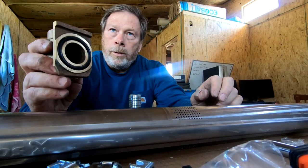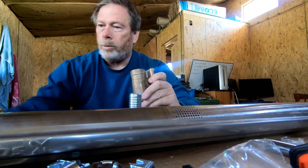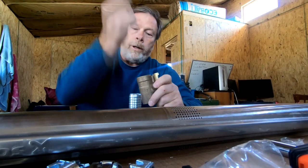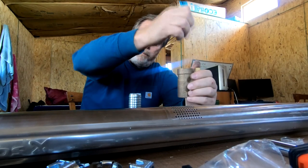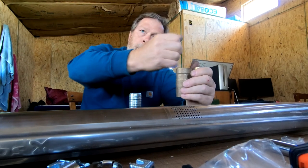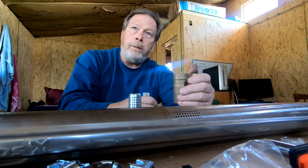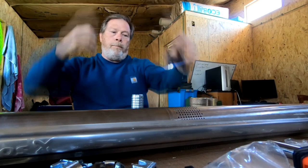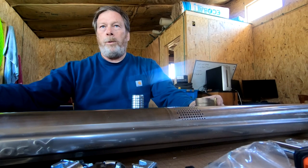So when you've fed all this down and you're holding on to the rope, your strain relief and stuff to hold it there, you'll then grab a hold of this and drop it into the pitless adapter. You use a strong piece of pipe so you can push it and wiggle it in, make sure it's a good tight fit. And then you can either unscrew the pipe or just leave it there if you want. And then if you ever need to work on it, the pipe's right there. You can just grab it, pull it up, unhook the pitless, everything else comes up with it. You grab the strain relief rope, you can pull it all up.